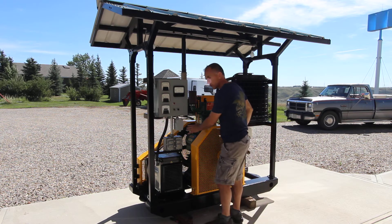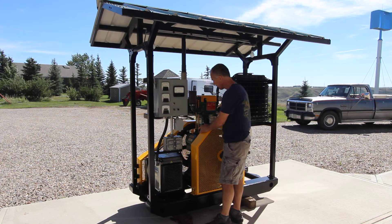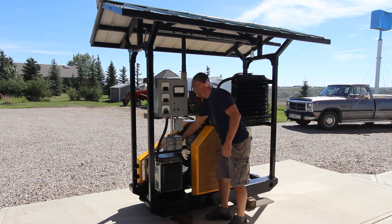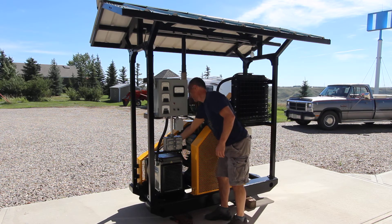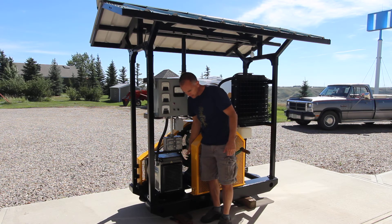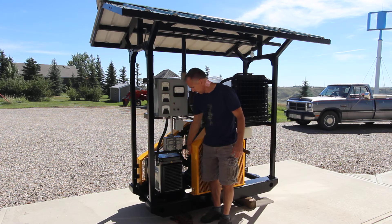I've checked the oil on this side of the engine — the oil is good. I'm just going to make sure our flywheels have a nice ringing sound to them; that's just a pre-start check. If they didn't ring, they can have a crack in them. But if they hold a nice ring, you know the casting is sound and safe.